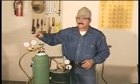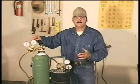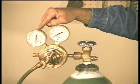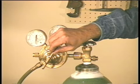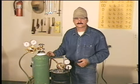On the oxygen regulator, the high pressure gauge reads up to 4,000 pounds and measures the pressure inside the bottle. The low pressure gauge indicates the working pressure coming out of the regulator. And this is a regulator adjuster. Screwed in increases the pressure, screwed out decreases the pressure.